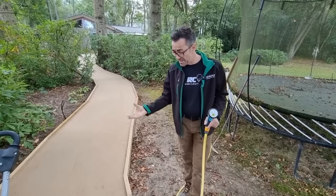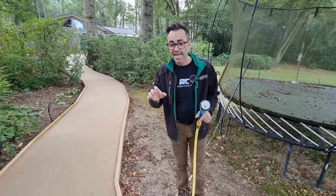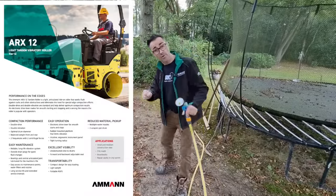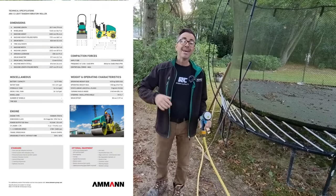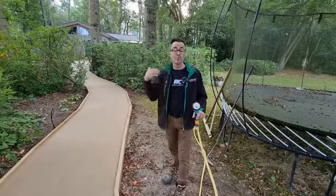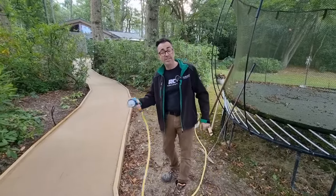Now, marl is obviously like the fines, and it actually bonds itself together, but you do need to introduce a bit of water. Now, in the case of doing a road or a major path where you've got the space, you can do a drive-on rolling compactor plate, okay? So you'd go up and down it with that. Then you'd turn off the compaction and you'd introduce water. A lot of these rollers have a tank and they'll put water on the rollers and up and down you go. And in some cases, when it's hot, someone will have to feed the roller with a hose.